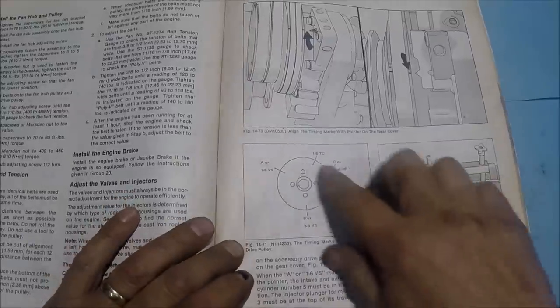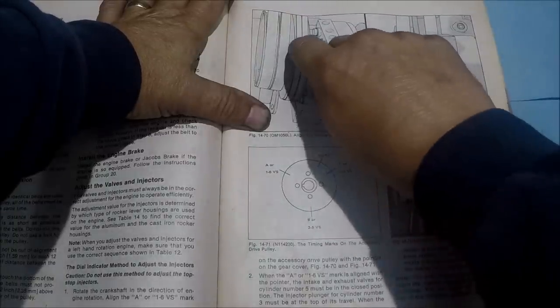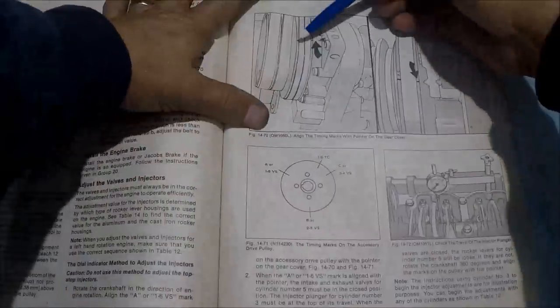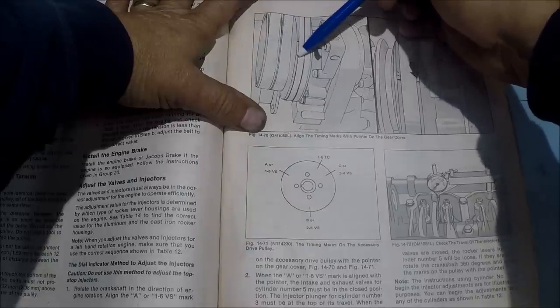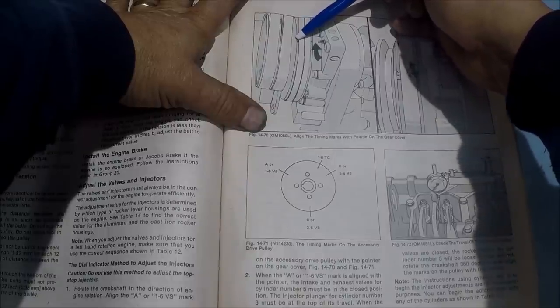And I'll show you on the actual truck where you can find these marks. They're usually marked on the fan belts, the water pump belts. It's usually on the water pump pulley is where you'll find it. On mine it has an A